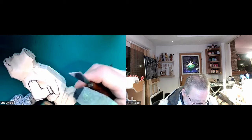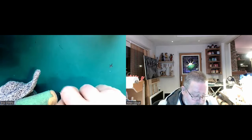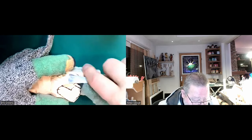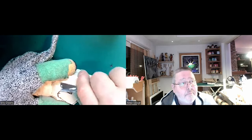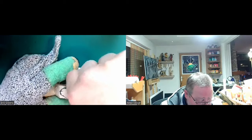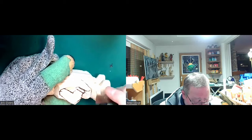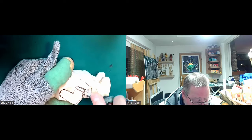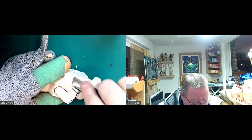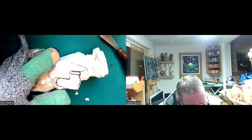So I've got my fishtail gouge, Drake 3/8, and I'm just going to carve. Gotta remember to stay right up there where you can see what I'm doing. I'm just carving right above that arm. And I'm just trying to trim some of that wood down because I don't need all that wood in there. I need a little bit out here rounded for a pocket. And I need to bring the sleeve up to where that pocket is tucked in. And then I need to shape the arm. But anyway, I've got a better tool than what I'm using for that. And I think it's this one right here.